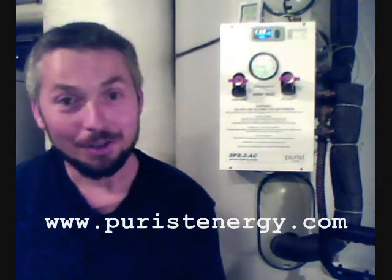Hi, I'm Dana, Purist Energy. This is the SPS2AC. You've got it installed, mounted on your tank, and you're ready to charge the system. How are you going to get that glycol in the system — that propylene glycol that's food grade — so that should anything happen to the heat exchanger, or for whatever reason all the safety features fail, it's not going to cause any issues with your water supply? Don't use antifreeze, don't use car antifreeze. Use propylene glycol. So there's that safety pitch.